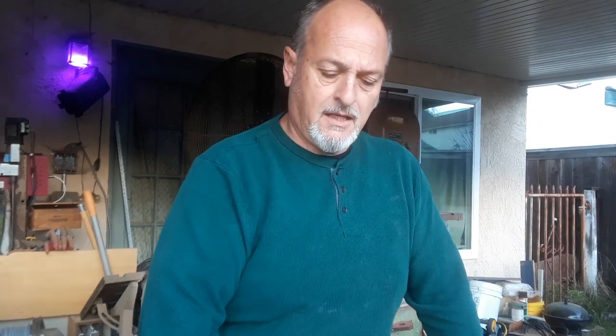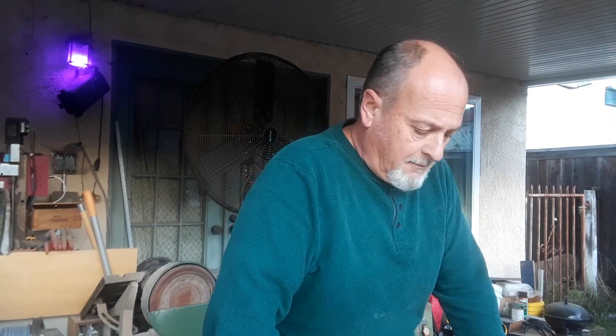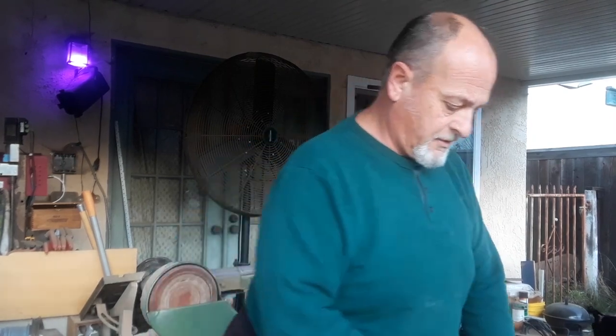Now, I was thinking about taking a face vise that I have on hand and using it as a tail vise, but I'm not certain that I want to do that. I can plane things along the surface using very long bench hooks, things that already have holes drilled in them and pegs in them so that I could fit things down, use wedges to bind them in. Because this bench top has developed a severe check right where I would put a tail vise. And I'm not sanguine about drilling holes all along the length where there's such a severe check. So I'm gonna find other solutions.